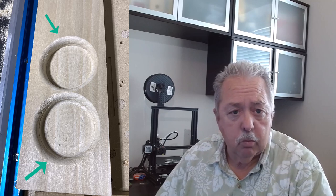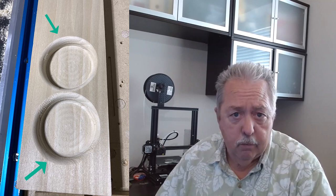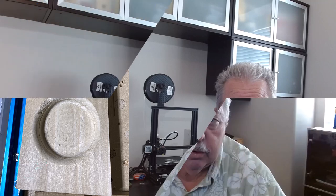I've been doing a couple things with specialty bits lately and I thought it might be interesting to do a couple small videos on specialty bits. Today I want to talk about roundover bits — these are bits for putting a roundover on the edge of your work or in pockets to make a nice smooth transition instead of a sharp corner like the one you see in the picture next to me. As you can see, it's a pocket and the edge of the pocket is nice and rounded over. It's a quarter inch roundover and I did that using two different bits that I'll talk about here in a second.